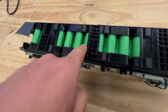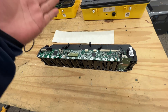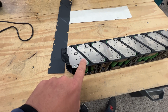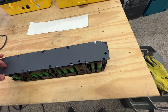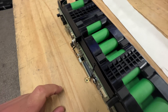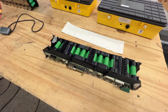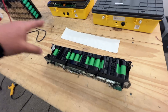Today I want to talk about this because it's very interesting. It's 14s4p — so four cells in parallel and 14 in series — so 48 volt, just typical 48 volt, really good for storage. These are VTC4s, Murata, which is the company that bought the Sony branch. So these are Sony VTC4 cells, capable of like 20 to 25 amps.